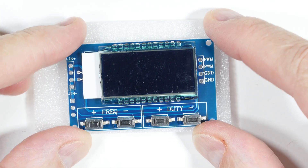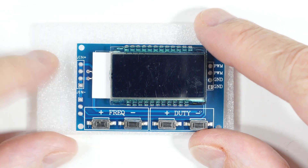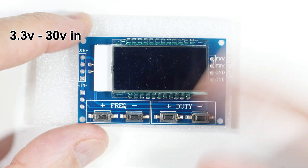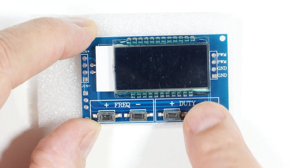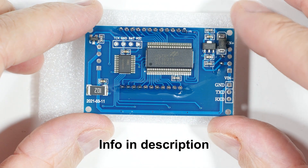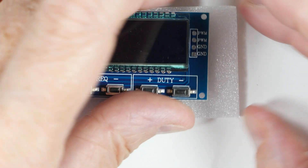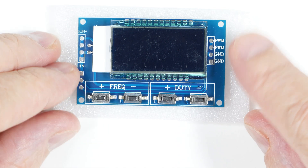This is not a kit obviously. There's a PWM output and ground, and here's the voltage in — I need to look up what that voltage is. Otherwise it's just got frequency and duty cycle and not a lot on the other side. I need to solder some pins in here so wires don't come popping off and short stuff out.